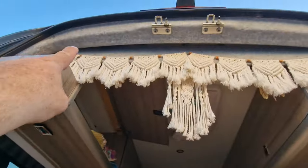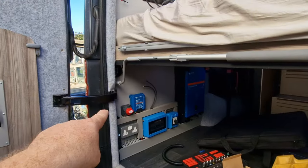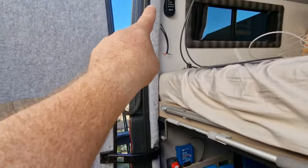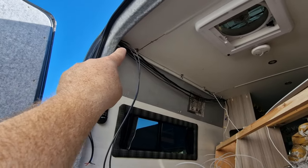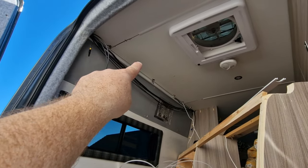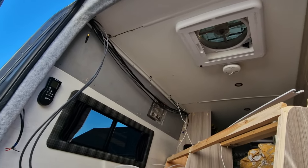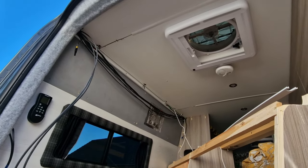Tonight's job: get that down, drop that cupboard, move that cupboard onto this side of the van. We've got the cable in — we managed to run it out in trunking right up through that pillar in the cavity, and then we popped it out at the top with the rest of the cables. What we'll do is we'll dress all that back in, but before that we'll take it along and pop it out up onto the roof. We'll make our roof penetration first.